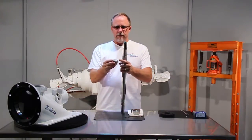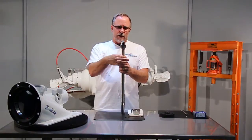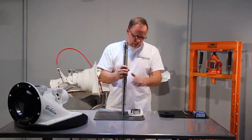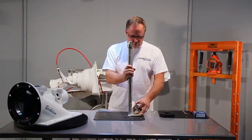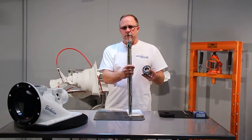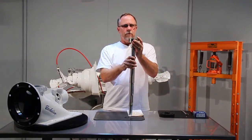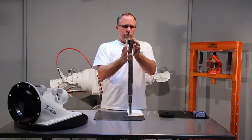To start, we'll take the shaft sleeve, take the chamfer, put it over the top, and it goes down. As we talked about before, there's a half moon in the bearing. It's going to go towards the motor — this splined end goes towards the motor, so that half moon will go up. That presses down onto that.